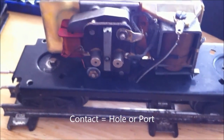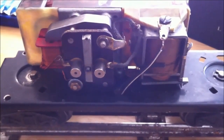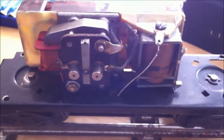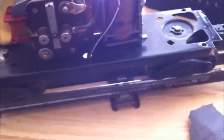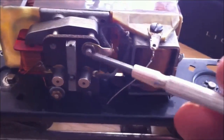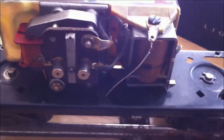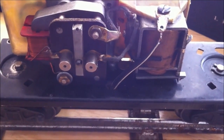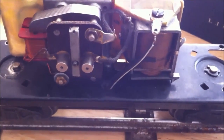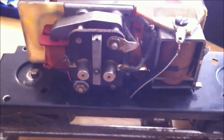One of the things I do with the LaBelle — as you can see this contact up here — is I usually add three drops to that, not more than that, because then it gets in on the spindle and starts to spin oil onto the brushes, which creates a mess. There's also a well on the inside down in this area, and what I like to do is tip the tender up on end and get as close as I can to the bearing, which is located down inside. About the only way you can do that is with a needle tip on the LaBelle oiler.